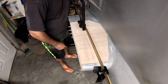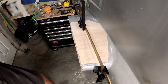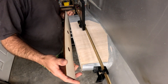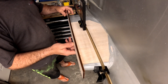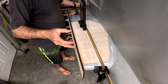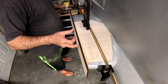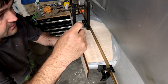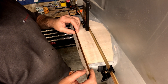The measurement is about 8/32nds. I'll make a mark on the plywood piece for the very trailing edge location. From there I will tack glue it at the back and then use an additional incidence meter to set the incidence of the rib blank. With the stabilizer rib blank put in place and tack glued at the trailing edge, the leading edge, and in the center, we're now ready to start cutting out the holes for the tube sockets.